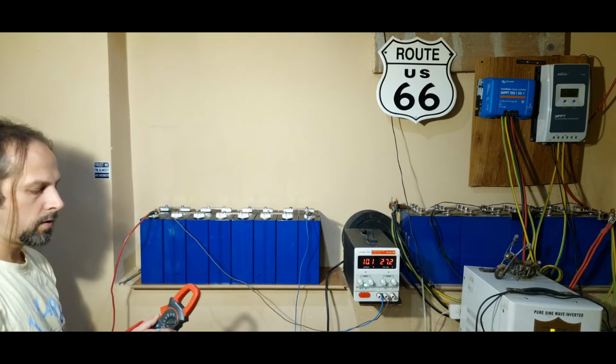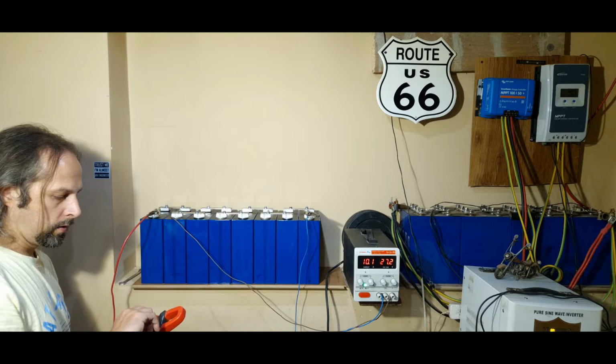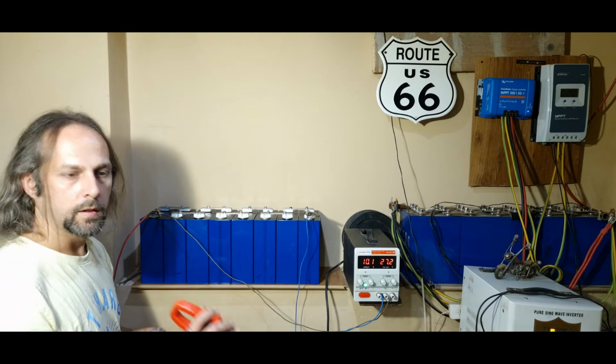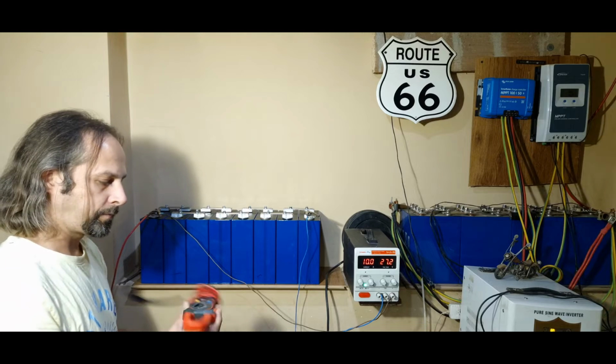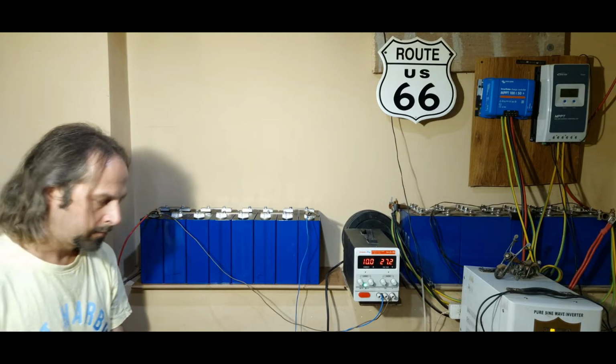Now we need to let them charge until every cell reaches 3.4, and then we're going to put it all in parallel and charge it to 3.5. I guess see you in a few hours.